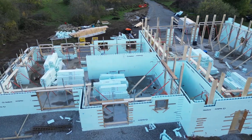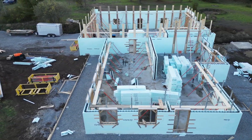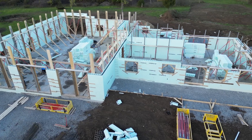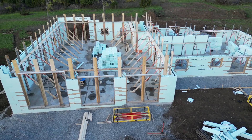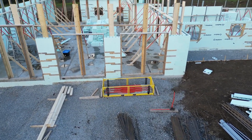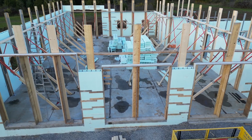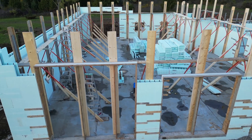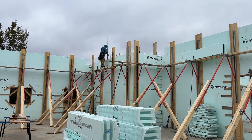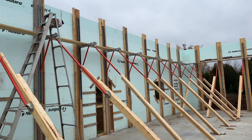The main floor of the house is set to nine feet for the first floor. When the cement trucks come, they're going to pour the entire 15-foot height in the garage and the nine feet of the main floor in one continuous pour. Kevin my builder was concerned because he's never poured a 15-foot high wall before. The cement guys said there's no problem — you just have to put a lot of board braces inside the garage to make sure the wall stays completely perpendicular and level with no sagging, bending, or leaning when they start to pour. About a day or two before the big pour, we were dropping in the rebar all the way down 15 feet into the walls.